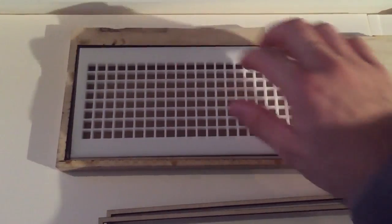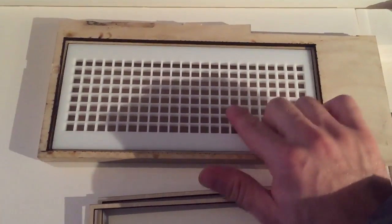Another thing I learned at Noisebridge was about the kerf on the laser that they have. It's about 0.3 millimeters. And I'll show you these three pieces I have here. The first is with no kerf correction at all. You can see that when I put it inside of the mold, it is very wiggly, and so it's really hard to tell how to fit these together.